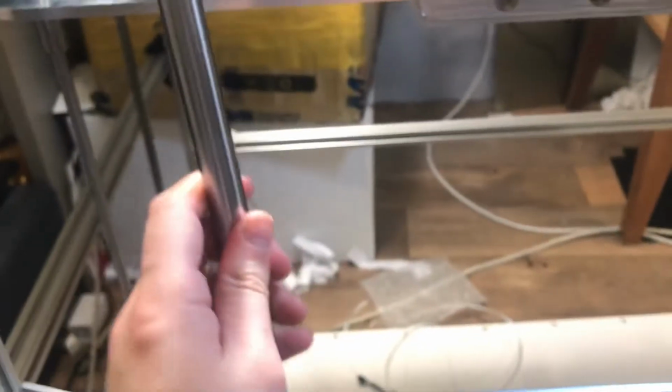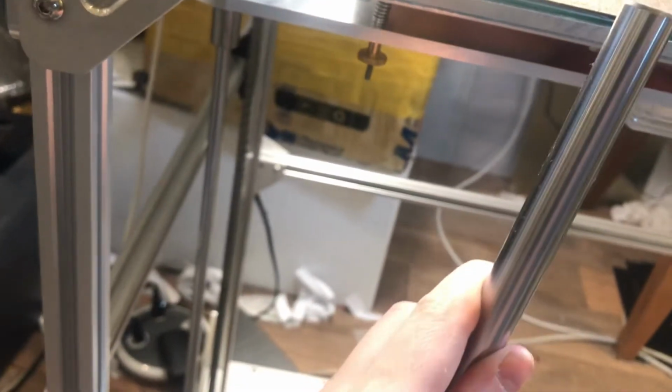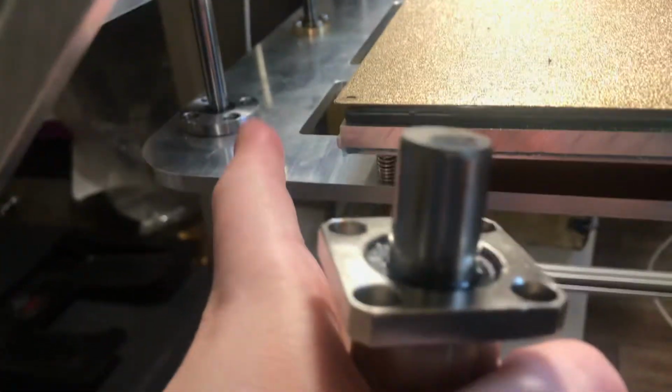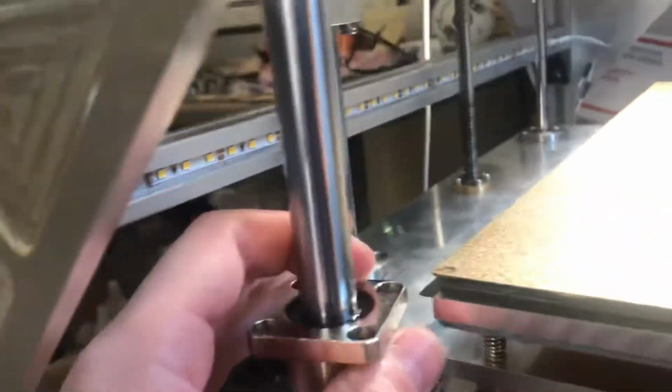I guess the last few things I wanted to mention are a lot of the things you see of the frame will be upgraded very soon to larger aluminum. And for example, these standardized 8mm guide rails are being changed momentarily to these 16mm thick guide rails for a truly rigid industrial machine bed. And you can see here the actual component attached to that is right here, just like this. It will be machined to fit up with the bed, and you can see the amount of rigidity and strength gained by that big of a difference.